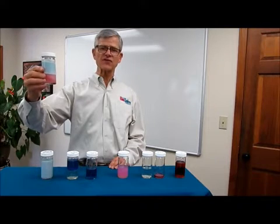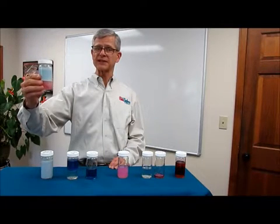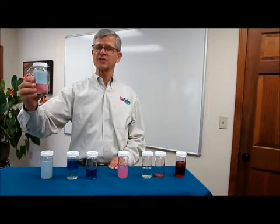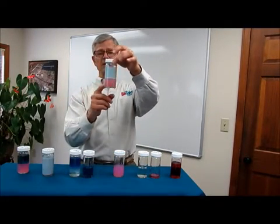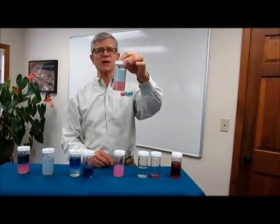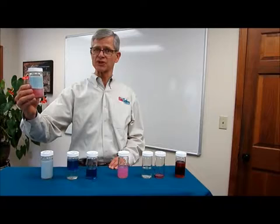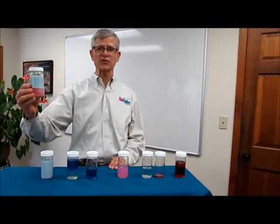This is actually a very good feature of pink water when used to clean hydrocarbons, because it means that the effluent from pipeline cleaning, tank cleaning, or spill cleanup can be sent to an oil-water separator or frac tank, where the emulsion will come to the surface and can be skimmed off for disposal or reclaiming. The aqueous phase on the bottom has a small amount of dissolved-phase hydrocarbons but can be cleaned up very easily for discharge to a wastewater treatment facility. In large tank cleaning projects, it may be possible to reclaim the hydrocarbons by breaking the emulsion after separating it in the frac tank, and that reclaimed hydrocarbon can be sent back to a refinery for reprocessing.